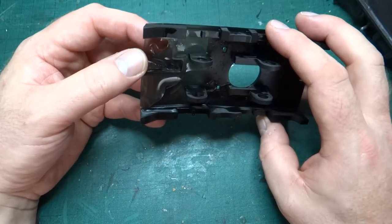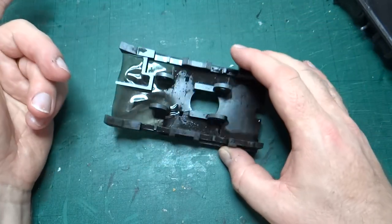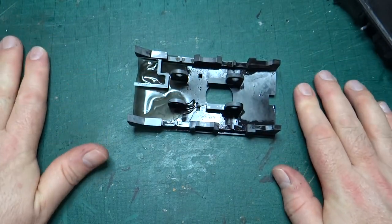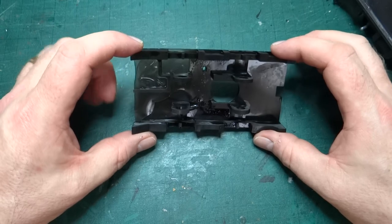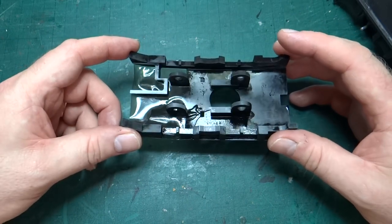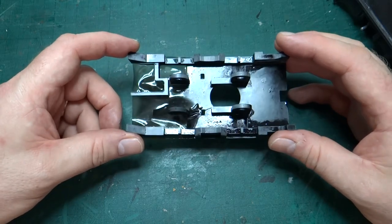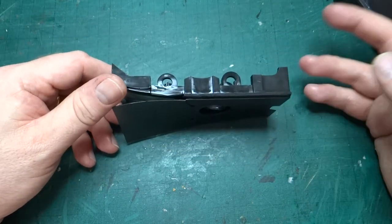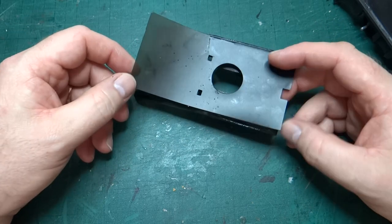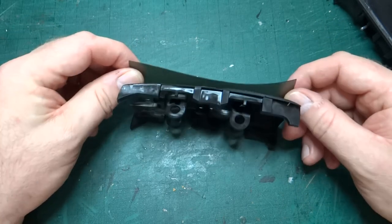It may be that I got a setting wrong. I've changed resin recently — switched to a new bottle of resin. It's supposed to be the same, but I'm wondering if I need to give it slightly longer. I'm not sure whether slightly longer on the bottom layers or slightly longer on all the layers. Everything else has printed fine, but this obviously went completely and utterly wrong.